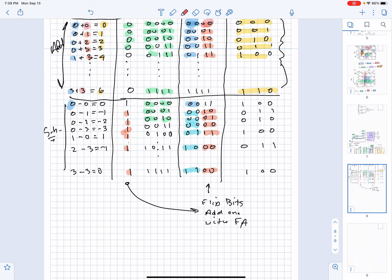To represent negative zero in 2's complement you flip all the bits and then add 1. We're doing the adding-1 part with the full adder circuit, and the flipping of the bits is done with the exclusive-OR. So with 0 minus 0, the result should be 0, but unless you modify the 2-bit full adder circuit, this bit is wrong — it gives 1 0 0 instead. The carry-out bit position is wrong for the subtraction part.